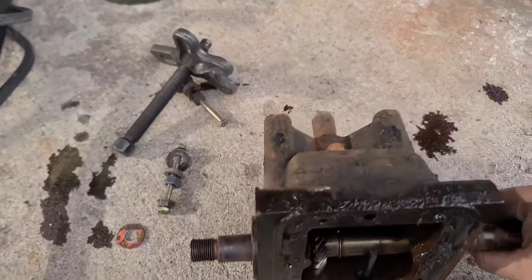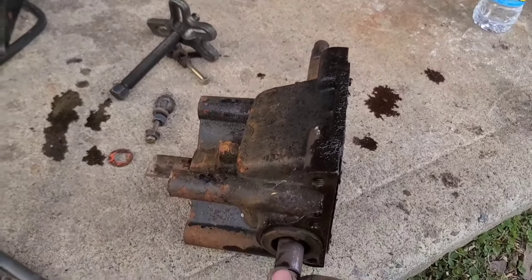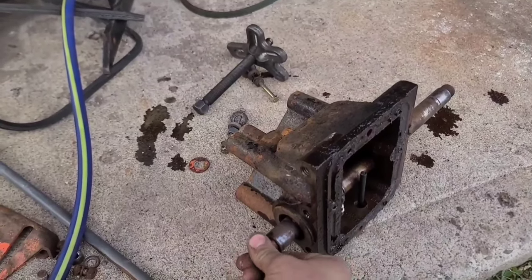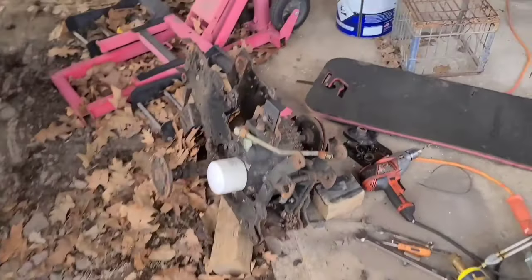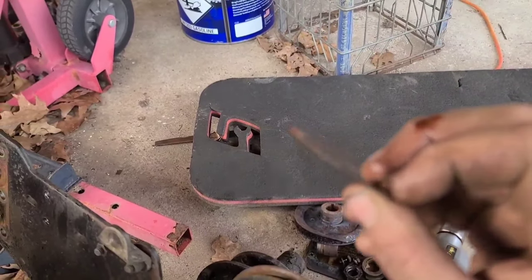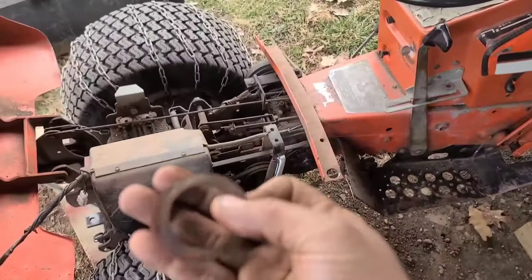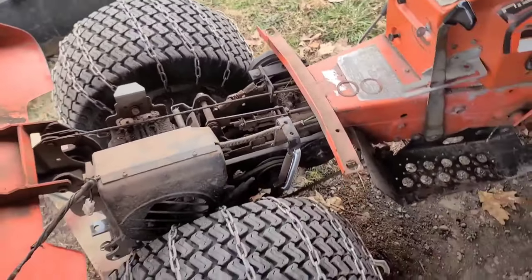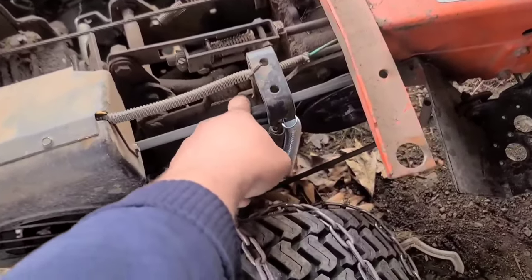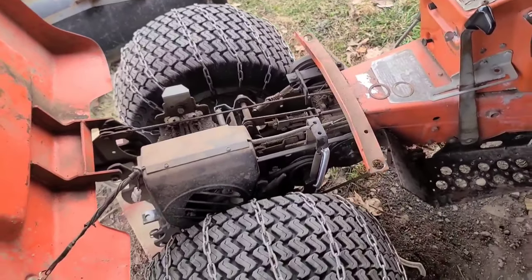The gears are in good shape and the shaft doesn't seem too bad, the PTO isn't worn too badly. How these work for the in-and-out play: I've actually put shims on the seal and the seal hits the bearing. This one's rusty so it won't move, but I took the shims off of this one over here. I'm going to use these shims to get rid of at least half the play. I might have more shims in my shed somewhere. We're going to have to take all the clutches apart and get this side plate off in order to get at the shims for that seal, which takes up the side-to-side play.